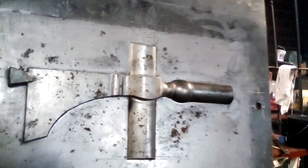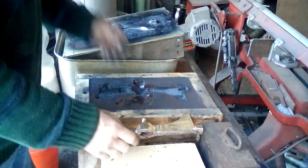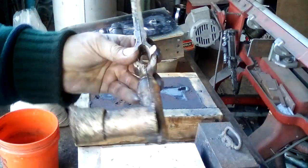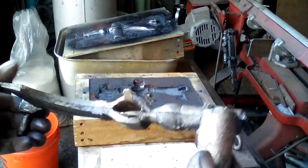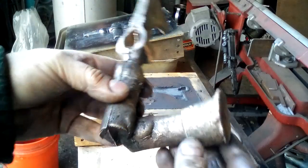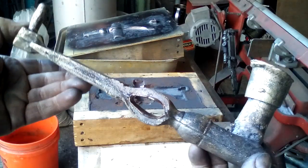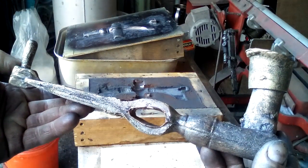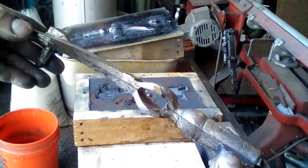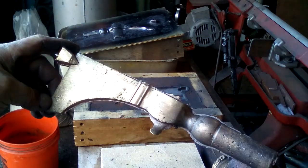We're going to go over and look at the furnace and the casting. We've moved over to the little mold table. This is the casting as it comes out of the flask — this is what gets cast. You can see it's got a little flange. There is a pouring gate and a riser on the other end. The eye is not perfectly centered, but that will get filed and corrected. Overall, that's actually a very decent casting. You always make them a little heavier with brass because you'll finish them out.